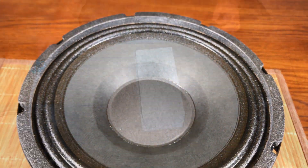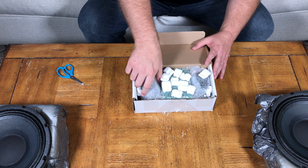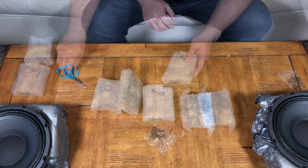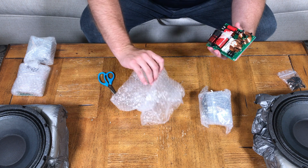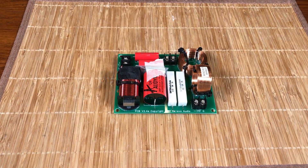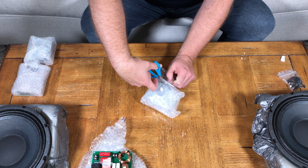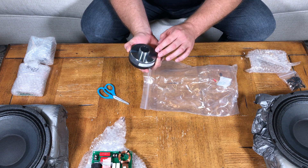To assemble this kit, you're going to need a few additional items. First, you'll need some glue — my favorite is Titebond III, it gives you plenty of time to work your pieces before it starts to set. You'll need clamps; my recommendation is somewhere between four and six 24-inch clamps, and likely some smaller ones as well — you can never have too many of those. Also, you'll need binding posts, and you'll need to think about where to mount those, whether on the bottom or on the sides. The back could be difficult, as these will sit pretty much flush against the wall, so you'll have to think about how you want to wire these up in case you want completely hidden wires.